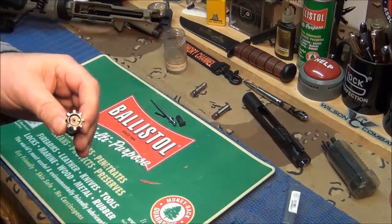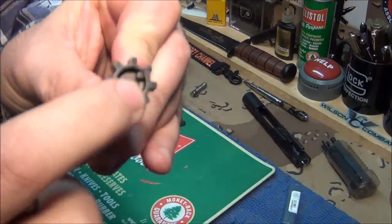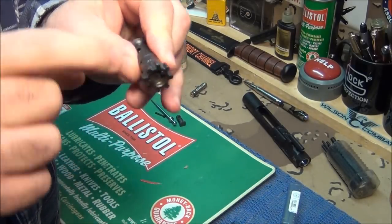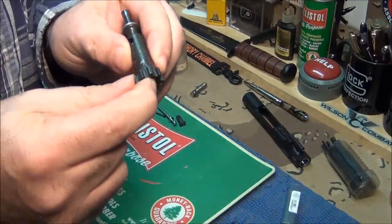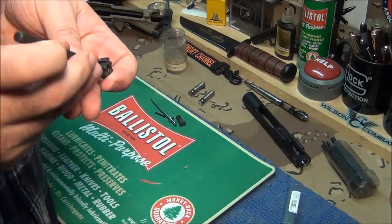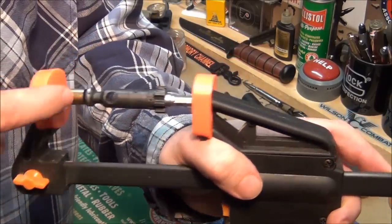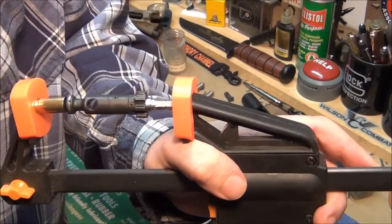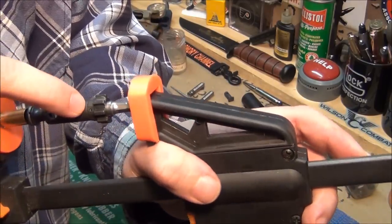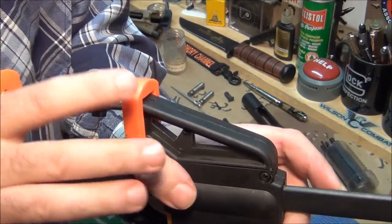What has to come out when you're checking headspace is the ejector pin. The ejector pin can't sit in there properly because it's under a lot of spring tension, and it's being held in with a tiny roll pin. What you have to do is compress that all the way and at the same time knock out that tiny little roll pin - that is a little bastard. I'd think this punch would be the one to use.